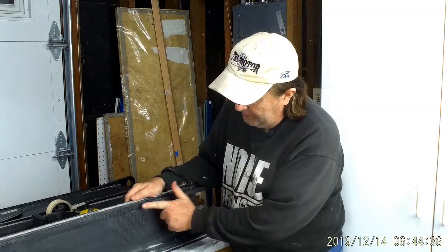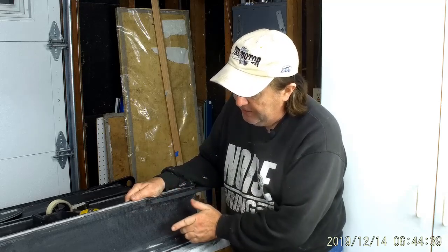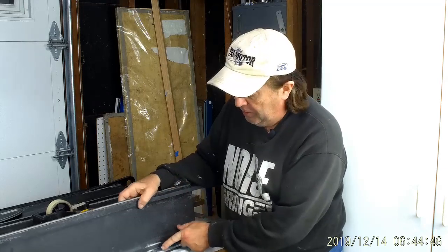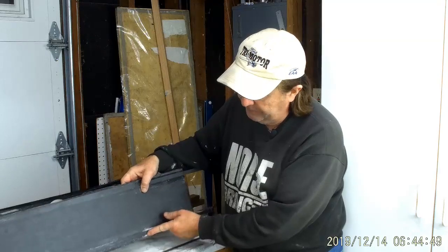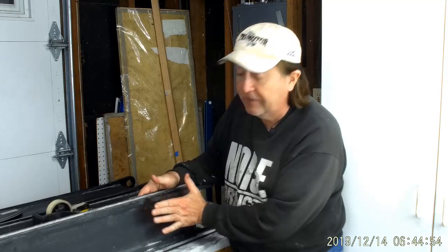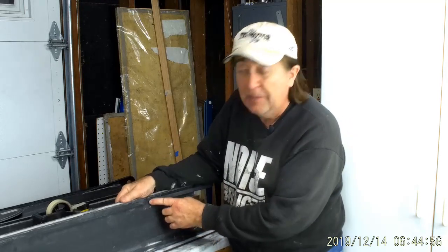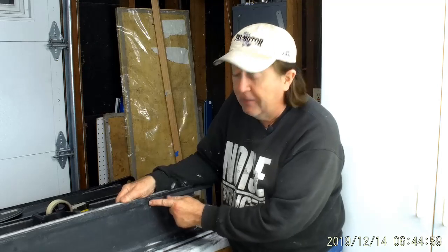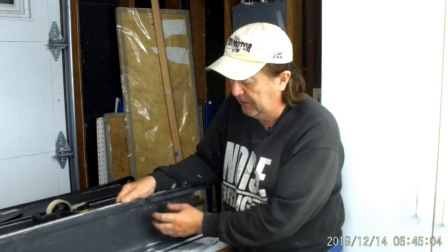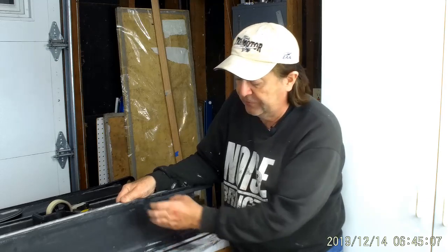And you think, well, that should be plenty of margin, and it should be. However, anytime you go on an angle like this, you turn a corner, when you're bonding this up, unless you're vacuum bagging, you do run a chance of having voids underneath. Now, you might be able to see here, I have some white filler here. I do put in structural filler in here so that when I put the strips on, it oozes into that filler, and that helps ensure that there are no voids, but you can't be guaranteed about that. And if you were to have a small void in here, well, then you don't have the area that you need to provide enough tensile strength to resist those lifting loads.